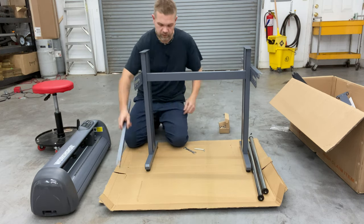You're going to have some nuts, bolts, and washers left over — they put in a lot so they don't count them one by one, so you get a couple extra. Keep them, hang on to them. Next step is we're going to mount the machine to its top plates. On the bottom you're going to notice there are table top legs, which is pretty neat, but we're going to unscrew those. Remember the long part of the arms is the front of the machine. On this back left leg you'll notice a green and yellow wire — that's your grounding wire, which will hook up in case there's static on the film or media you're cutting, to help ground the machine down. I've got all four of those off. I'm going to line those holes up and set our machine right in it and take all four legs and put them right back on.